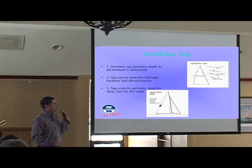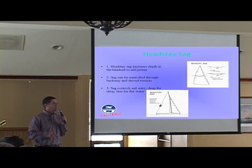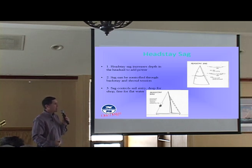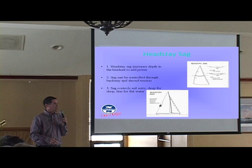The Cunningham is really the same as halyard, so let's just talk about luff tension. You're separating out two different components: forestay sag and luff tension. The luff tension is how tight the cloth itself is, and the forestay sag is independent of how tight that cloth is. So we can have this same sag and have a radically different look on the sail. You could have a whole bunch of scallops right on each jib hank — the scallops are just showing you how loose it is. The equivalent on the main would be those wrinkles along the sail. Or you could pull those scallops out or even have it stretched. On a J-24 for example, in lighter air we want scallops, and by the time it's super heavy we want it stretched, with a progressive adjustment in between.